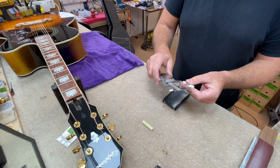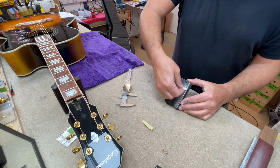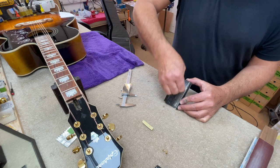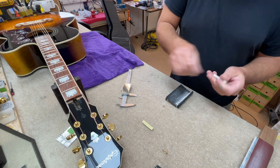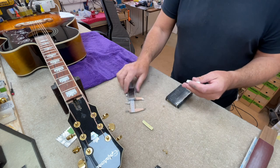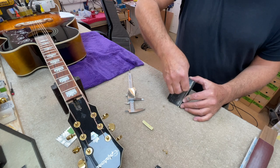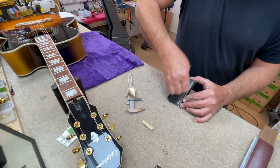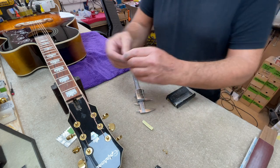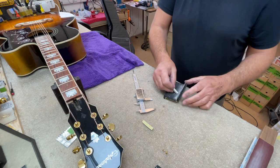And that again, really, there's only one way to do it, and that's careful work with the sandpaper. So I'm just working my way very carefully to the width. The reason for that is it's incredibly easy to overdo it and end up with it looking a bit short and feeling a bit odd. So it's better to just approach the correct size bit by bit, and you can put it on and you'll feel the flush or the overhang. So while it's still overhanging, we'll take a bit more.